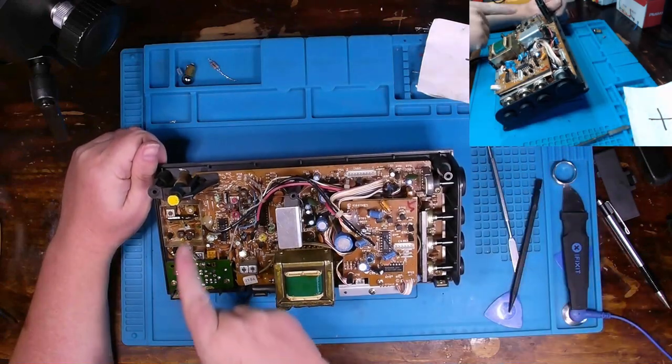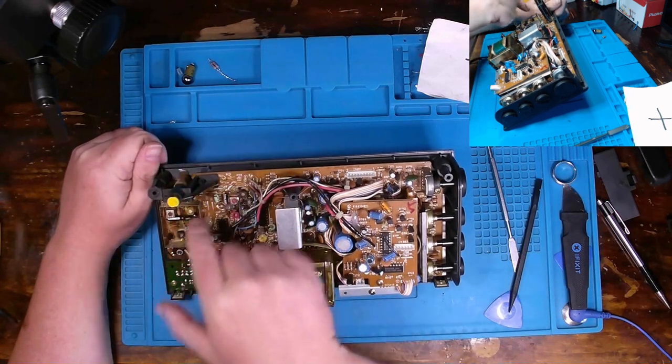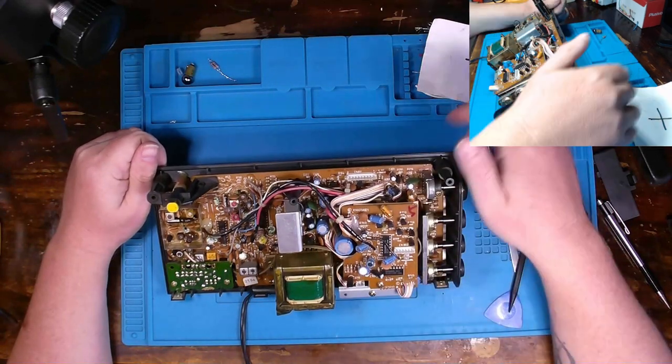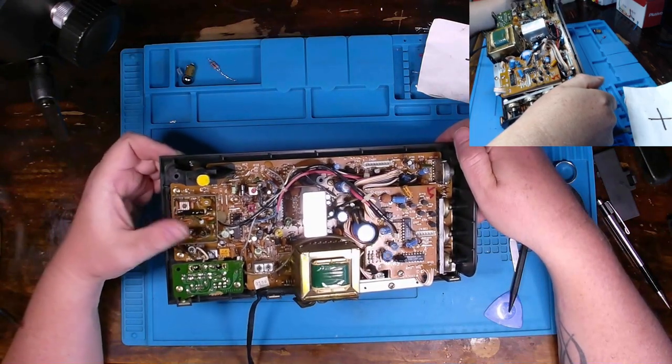I'm going to have to be very careful that I'm not breaking any of our wires coming off of this coil over this ferrite rod sitting in here. I don't want to break any of those, because that's going to affect our antenna. But, man, was there a cover at one point? I see outside shielding, but nothing over top.